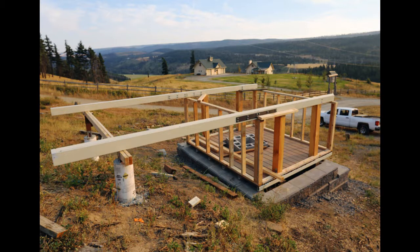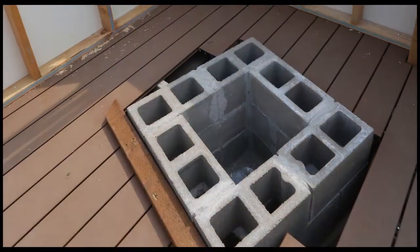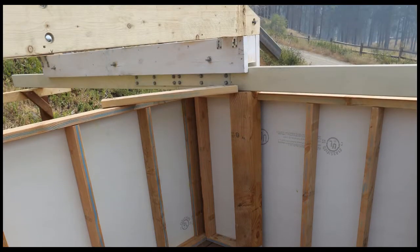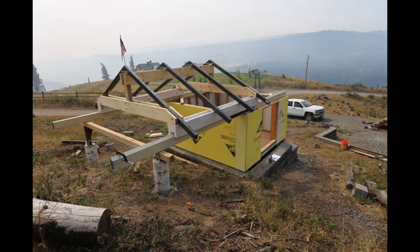The rough framing is done with Drycon fire retardant 2x4s. The framing was then sheathed with a commercial fiberglass gypsum sheathing board. It's also fire retardant, can be exposed to the weather for up to 6 months before receiving the final outer sheathing. The roof also uses steel rafters.